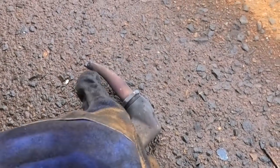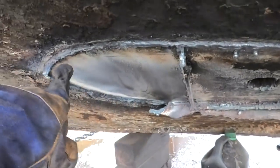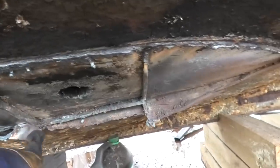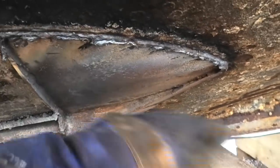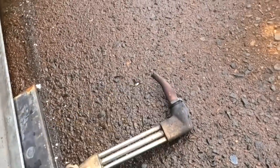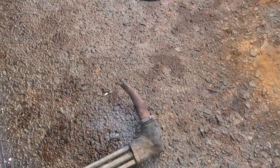I've been using this gouging tip to get the rest of the transducer box off. It's been doing a good job — gets it close enough that I can grind the rest. Better than having all these big chunks. I've still got to do the back here, a little bit trickier to get to. What I've also been doing is putting the wire wheel over here first to get cleaner metal for the heat to conduct into. Big thank you to those viewers who mentioned gouging tips — I never knew they existed and I've got to say it's the perfect tool for this job.